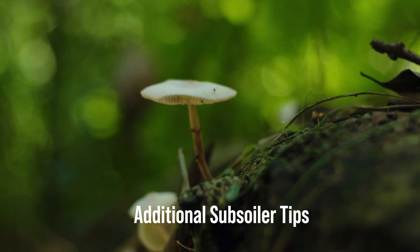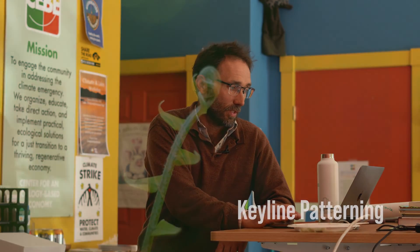You're not trying to sink this thing as deep as you can on pass one. Usually what I've learned is to dig some test pits and see how deep the topsoil is and how deep plant roots are growing. I also use a soil penetrometer, which measures compaction or resistance — you push a probe with a pressure gauge into the soil. They say beyond about 300 PSI, plant roots struggle to grow, so you can find where that initial restrictive layer is. On my first passes I've gone about 8 to 12 inches deep, then subsequently following with deeper passes to full depth, hopefully addressing the problem at least for some period of time.